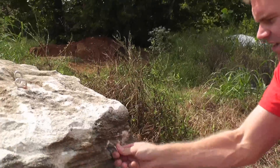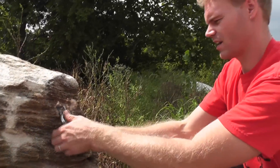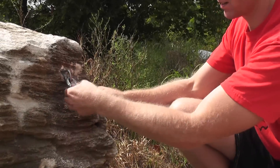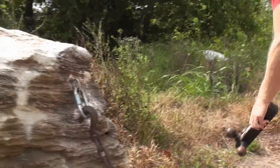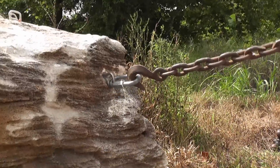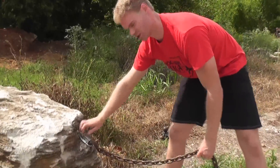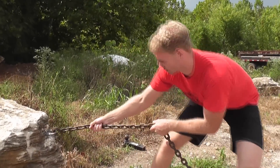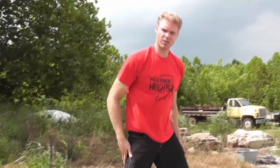Okay, so it's been 35 minutes, so I'm going to stop the timer here. This is real good and hard in there — the glue is all hardened up — so we're going to hook up a standard half-inch quick link here, hook up the chain to it, and move this stuff out of the way. First I'm just going to give it kind of a tug with my hands here to show you that it's in there. Now remember this was an oversized hole and we just pushed the bolt right in, so it's not holding on its own at all, it's just purely the glue — so you can see that's my full body weight there. I'm going to go start my truck and we'll give it a little pull.